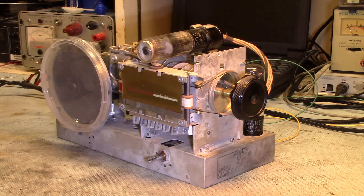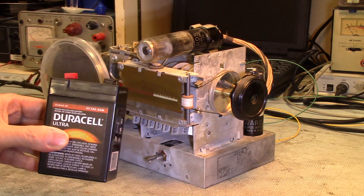Previous to the development of mechanical vibrators, the really early radios used multiple battery packs. You'd have batteries that would produce your grid bias and filament power — A batteries, B batteries, and C batteries. The nice thing about mechanical vibrators that were developed is it allowed you to just use a single battery.